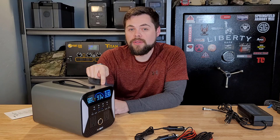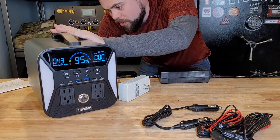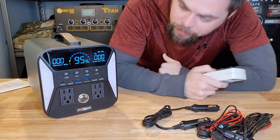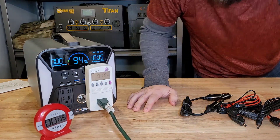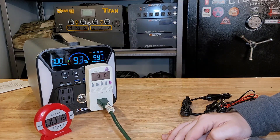I'm going to put a 1000 watt load on this and see how long it runs — a 1C rate discharge. I tried to top it off and it's been going for about 20 to 30 minutes and only gone up by 2%, so I'll add about 60 seconds of wiggle room for its runtime overall. I'll check in when this is done.